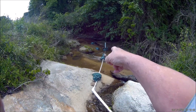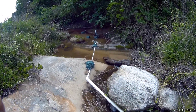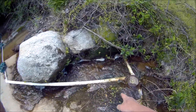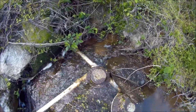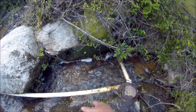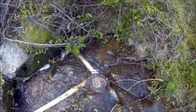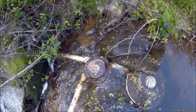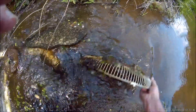That's my drive pipe — 20 feet of three-quarter inch drive pipe for the ram pump. I have a couple of sandbags on it just to keep it from wiggling around, and I've got that connected to about 10 feet of two-inch pipe that connects to another section of two-inch pipe with a T. I used a T because I couldn't bend that two-inch pipe around these rocks — I had to run it in a straight line, and the T prevents it from being pushed out of position. I'm also using an old brake assembly to help hold it down and the front of a desk fan to help take care of some of the debris.